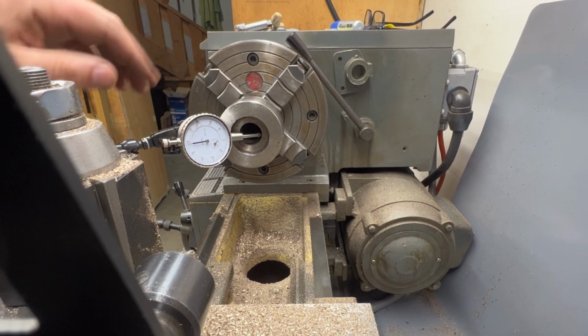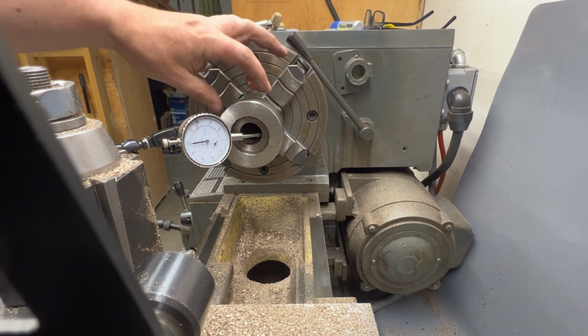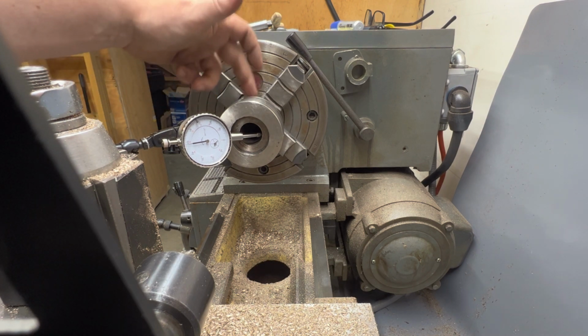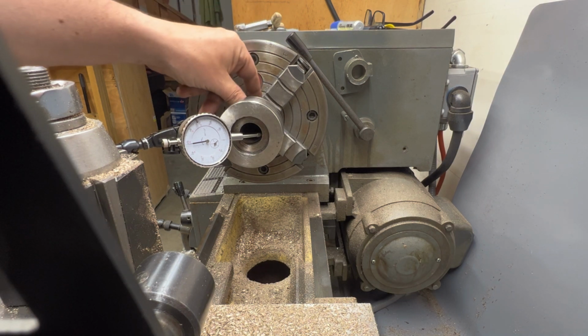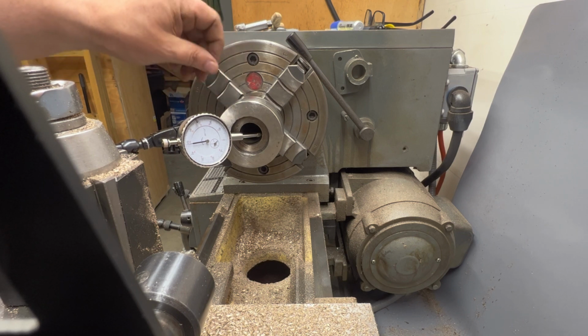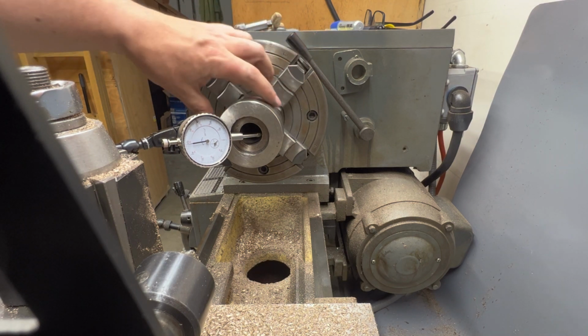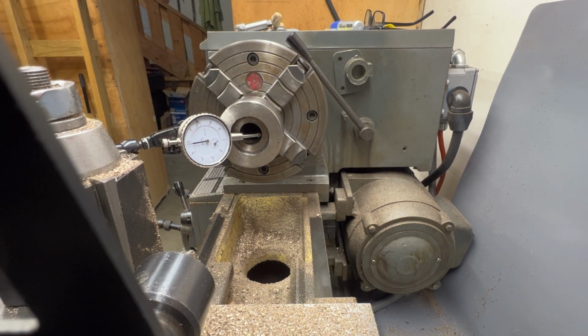If I think out loud for a minute, we need to align the outer pulley with the inner. The runout here on this outer portion of the back is irrelevant. So I think what I'll do now is dial the four-jaw in on the outside of this part of the pulley, and then test to see versus the inside how it looks.